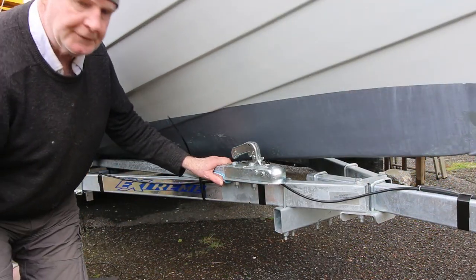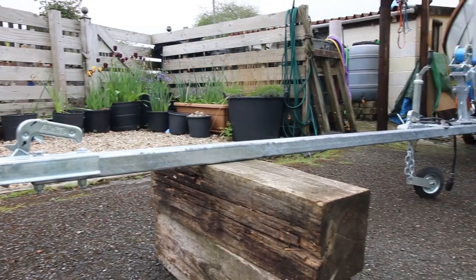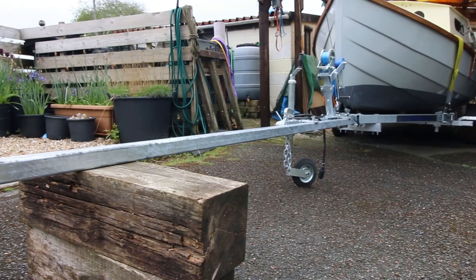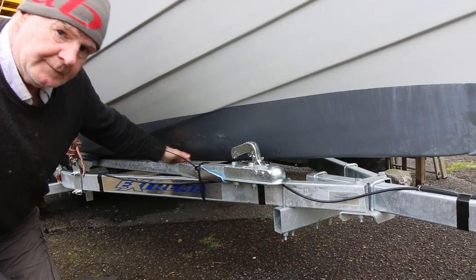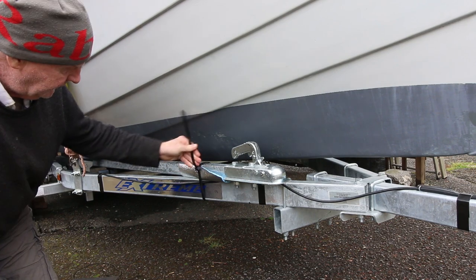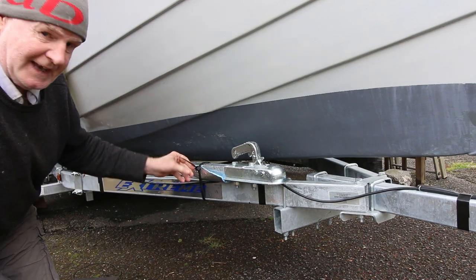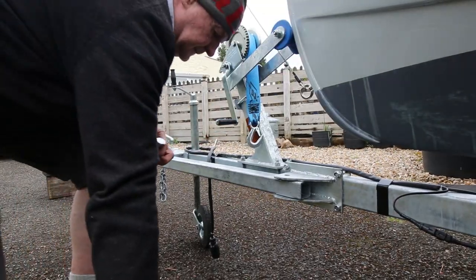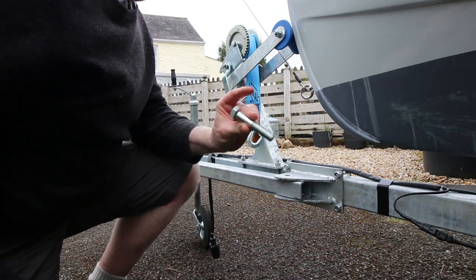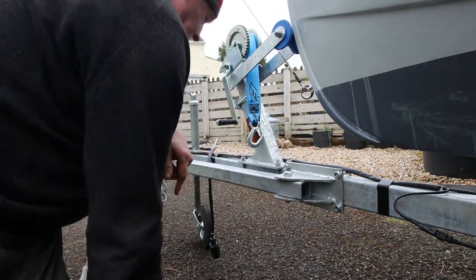And here at the front of the boat again is the drawbar tong for extension bar, which is stowed underneath the boat, and it's secured to the trailer frame inside just with these 600mm, 8mm cable ties. They're enormously strong, and so that's on, just needs tightening down. And in fact, I'm going to take it off for a moment and just show you the mounted position.